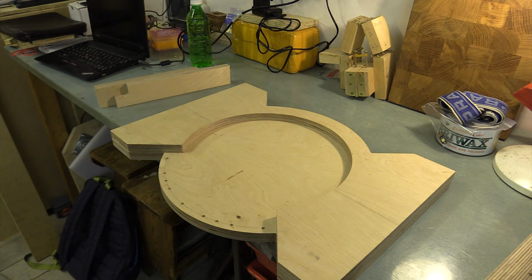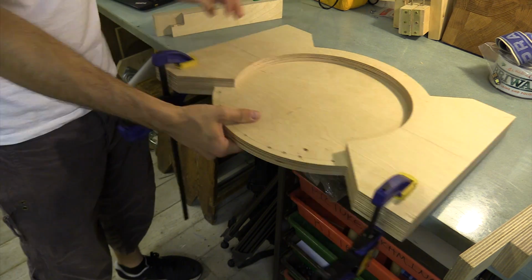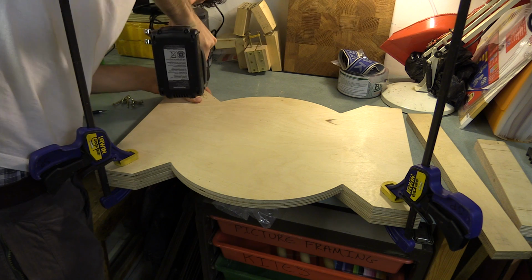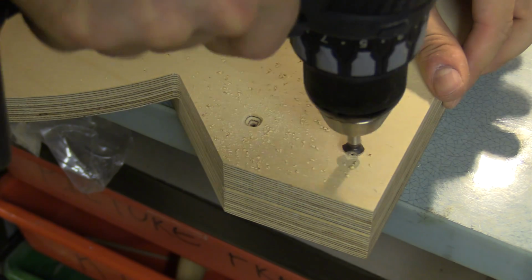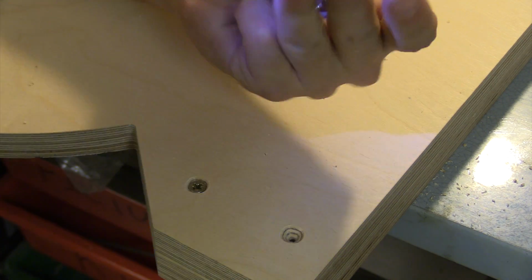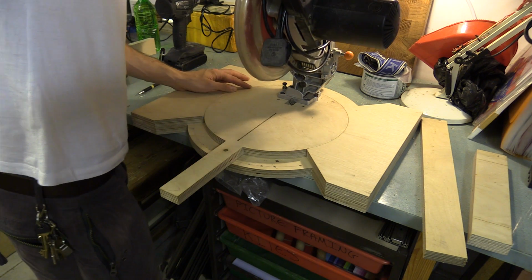I'm now going to make the fence, but I will begin by securing the base of the mitre saw to the collar which will hold the turning component. I'm not using any glue either, as I'm planning to dismantle everything at the end and varnish the individual ply pieces. The turning component fits and you can hear the clicks of the positive stop.